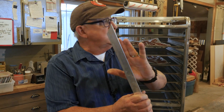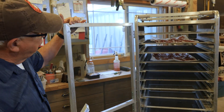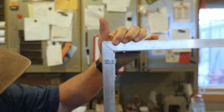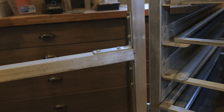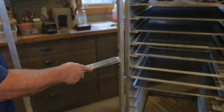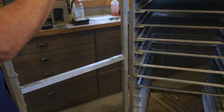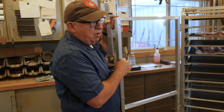This is a piece of leftover stock from when we constructed this door. What we did is use 45-degree miters on all the corners to create this rectangle, then used a brace spreader bar in between to beef up the door. We also used corner brackets that allowed us to have two screws on each side of the bracket, so the bracket doesn't pivot — it keeps everything rigid and that created the door frame.